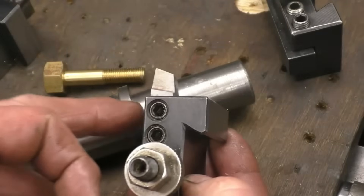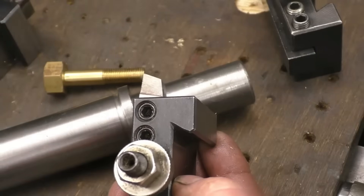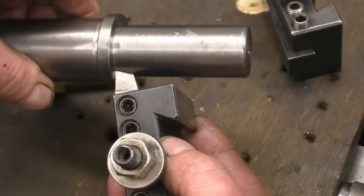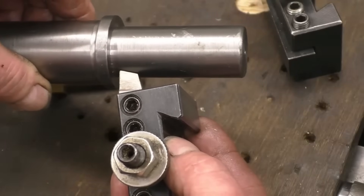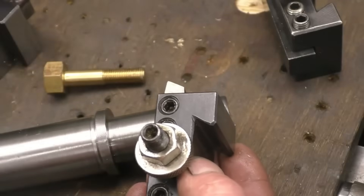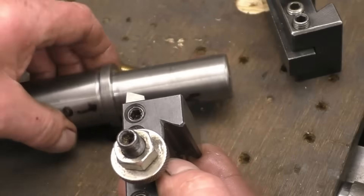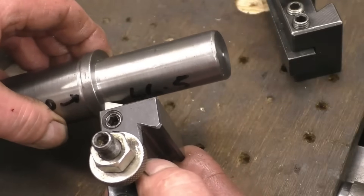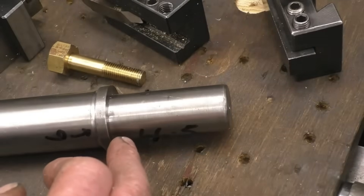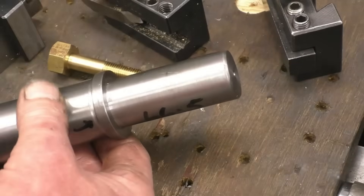You can use either a factory-formed tip or a hand-ground tip. If you notice, the angle between the two faces is less than 90 degrees, which means you can get the tool into the corner — you can cut on that face and then pull out and cut on the other face. If the tool was square at 90 degrees you wouldn't be able to do it. The radius on the end of the tool determines how tight the radius is going to be on the inside. Sometimes on shafts you need a radius to give more strength, but it might need to be undercut if you've got a collar to go straight down onto there.